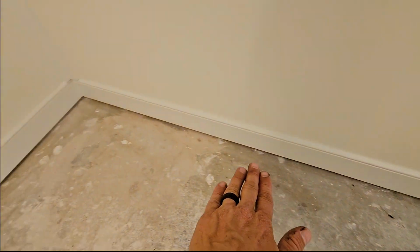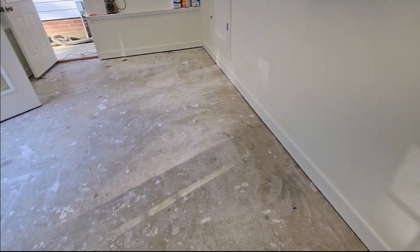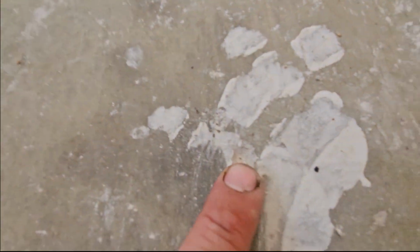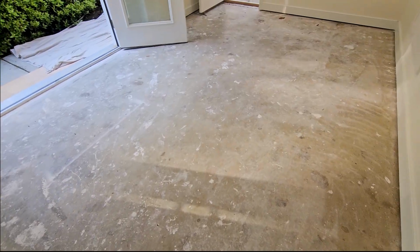So yeah, going to be grinding down the floor, coming through with our small Hilti DG 150. Going to be doing all the edge grinding here, getting underneath here. No verticals today, which I love. Usually we have to do vertical stem walls, but today, not that, just doing the floor. Once we're done with the grinding, the prep work, there's probably going to be little repairs. I see some spall repairs right here. We're going to use our CFS 2-part polyurea crackfill. I'll show you that in one second once we get rocking and rolling.